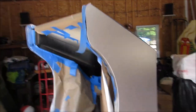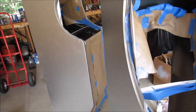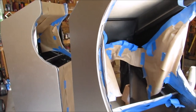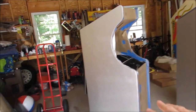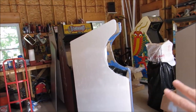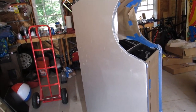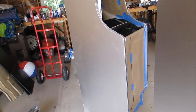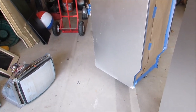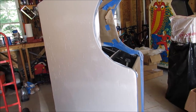Oil-based paint definitely took some work to get used to. It thins quicker than the latex I'm used to, so my quart didn't go as far. The original cab was given to me ready to paint — I touched up a couple spots and painted it. But if we stand in certain lights you can see every spot that was filled shining through. I think people online call them shiners.